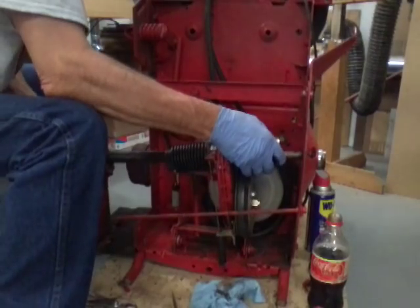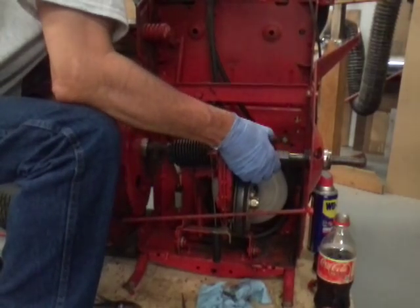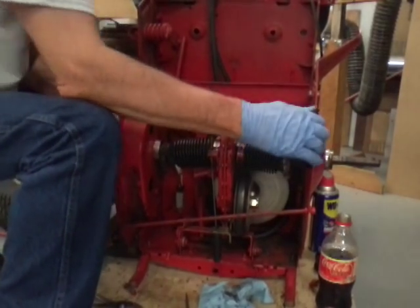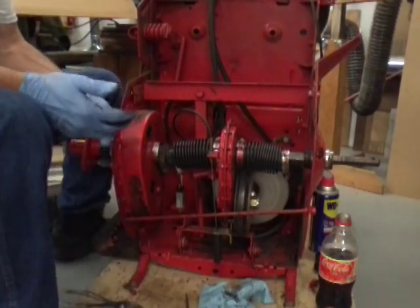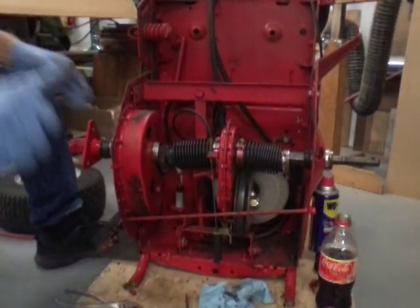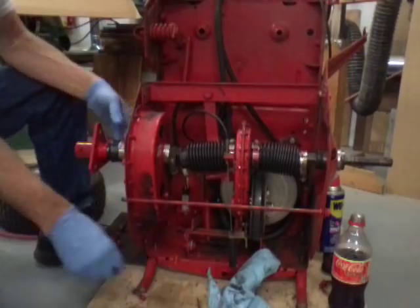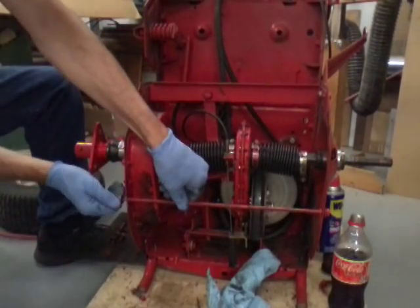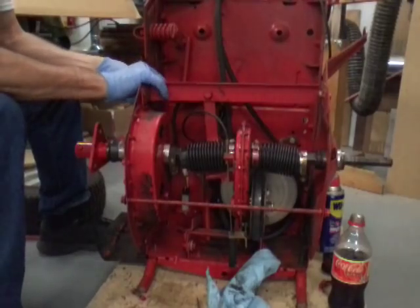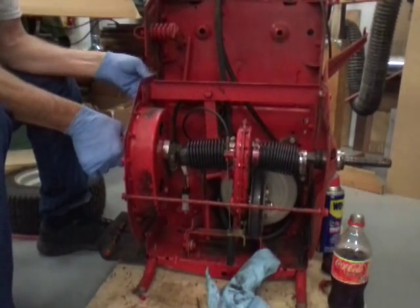My linkage came out of the spreader bar up here, giving me a little bit of trouble. I want to make sure that thrust washer is snapped into the hexagon shaft the way it's supposed to be, and we'll shove it back together. Now all that's left to do is put the bolts back in, get that spreader bar in there where it belongs, and get these bolts started. You want to make sure you get all of them started first before you tighten any of them up.